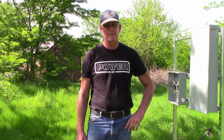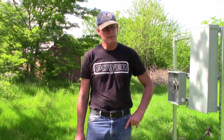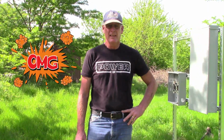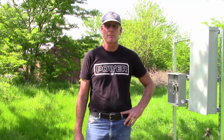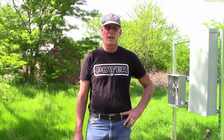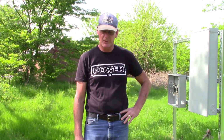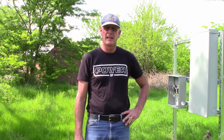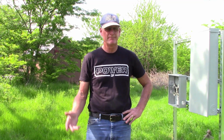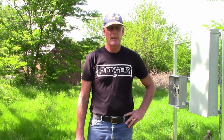All right, well, the electrical cable I bought was too short. I thought I was buying it long enough, but it's 4-aught and 2-aught, which is big. And so it doesn't bend well where we need to go. And the way they want us to wire it, it has to go up to the top of the box, down, through the bottom, and then in the other box. So I'm gonna have to buy a longer wire. Sad for me, it's $4.72 a foot, but not a huge deal. But I do have to drive a long way to go get it.